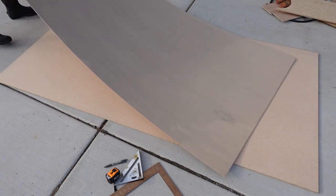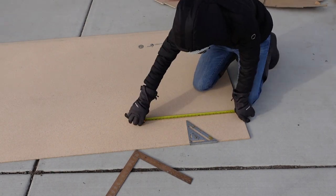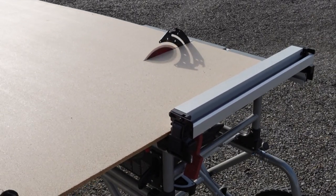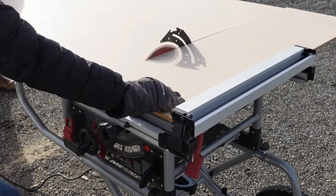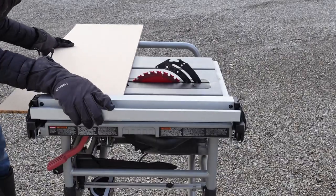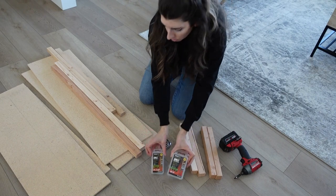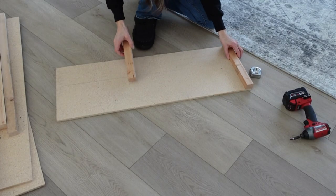I love the mirrors but I'm ready for a little bit more. So I went to the lumber yard and picked up some oak paneling and particle board. The original plan was to get one-by-twelve oak boards from the store, but they only had one-by-sixes. They didn't have white oak plywood either, so the lumber yard was the solution. It cost me $66 for all the supplies. I used my table saw and ripped everything down to size. I made the shelving 13 inches in depth instead of the full 15-inch built-in depth — it doesn't sound like a lot but it made a huge difference in appearance.